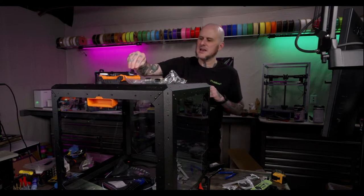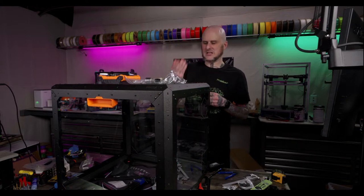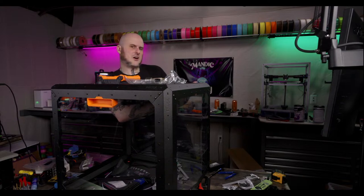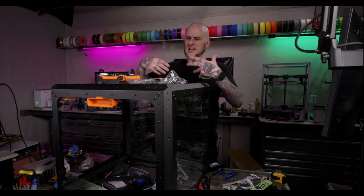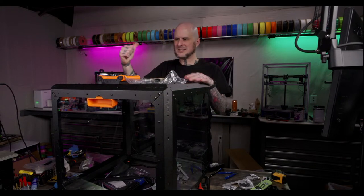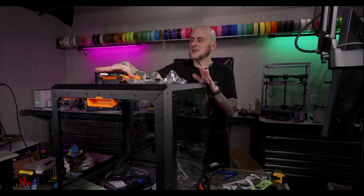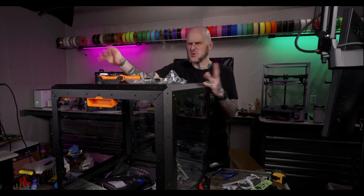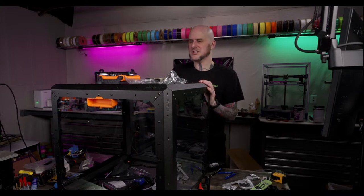Oh, okay. Yeah, see, that's the problem. It's better to have an internal filter system so that it recirculates the air and doesn't reduce chamber temperature, and also doesn't draw in air. With an external exhaust, like the stock Voron design box, I understand running it after your print, but during the print it doesn't help. It just draws air in through all the cracks in your machine. It's going to cause issues.